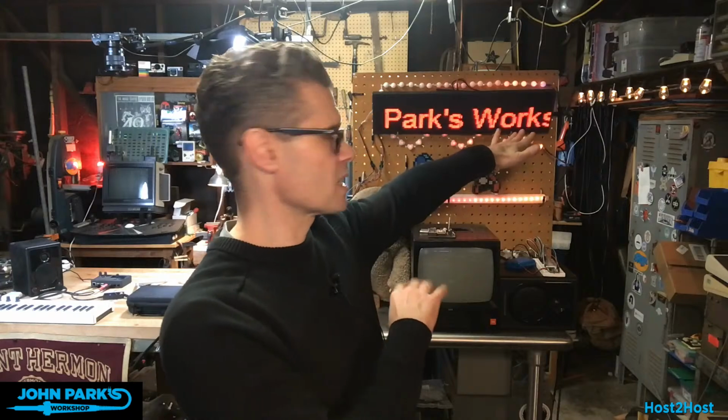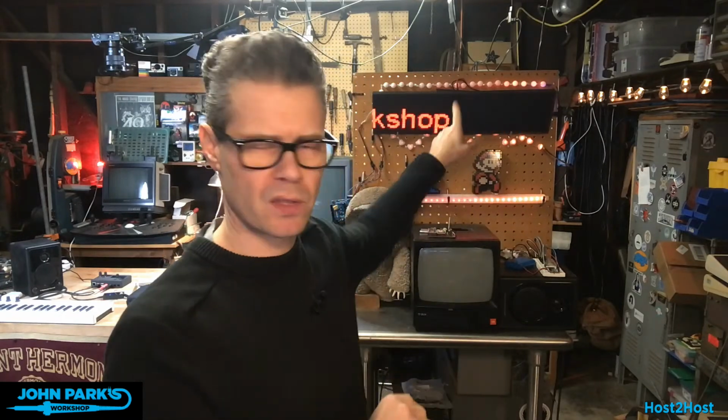Ooh, you know what would have been slick? If I had thought of this. Let me go over to my Messages app. I can change that display by typing in text, comma, Fugue State. If you didn't catch this on my show about the Matrix Portal S3 on Tuesday, this is internet connected using the SMS power-up on Adafruit I/O. I have a special number that I text to, and every 20 seconds or so, this will check Adafruit I/O to see if we have any new messages to display. While I've been stalling here, it headed up there and grabbed the coupon code. So there you go. Maybe that's my new way of posting the coupon code. Probably both.